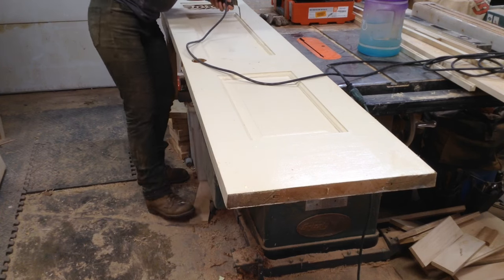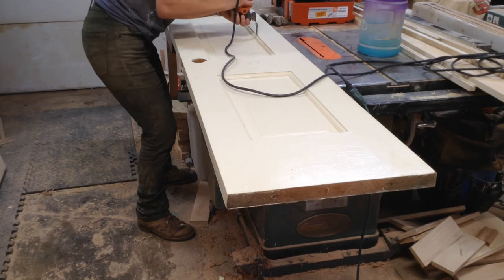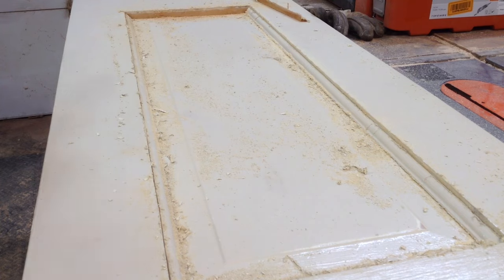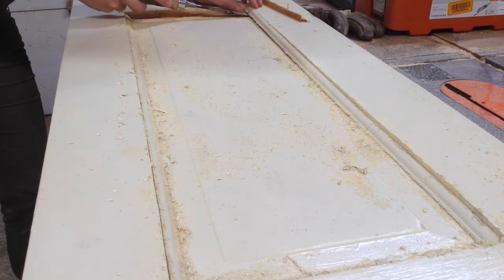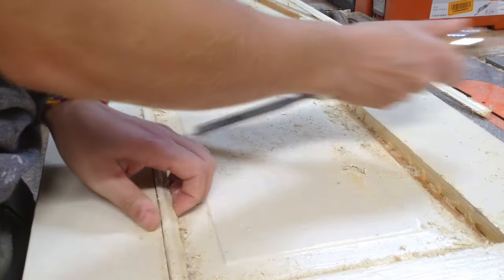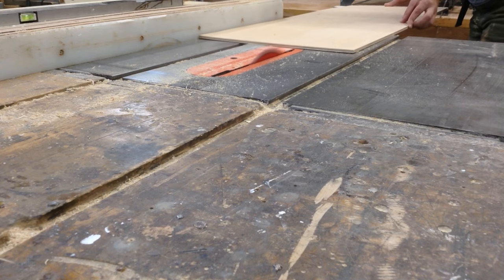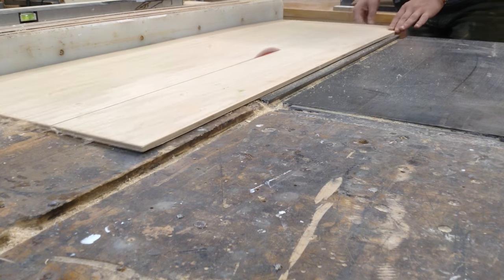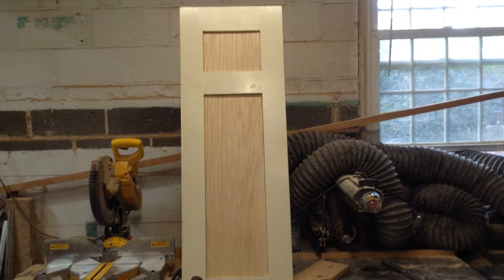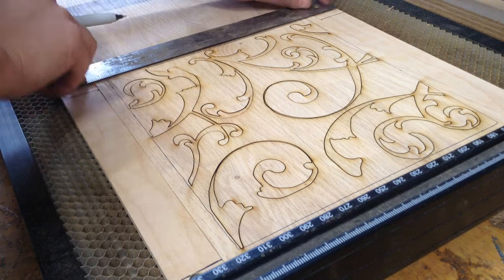The catalyst for the design of the door was the closet itself — it smelled terrible, and especially in the summertime when old smells are reawakened by humidity it really had an unpleasant odor. So I wanted some breather holes in here because linen closets in general are small stuffy spaces, and I don't care how many cedar bags you put in there, they eventually just start to smell. I had permission to get as creative as I wanted, so I decided to take the panels out of these doors. These hardwood doors are really nice quality — they're put together with mortise and tenons. I knew I could take that trim off the front using an oscillating tool, pop out the panels, and then use oak panels in their place. I was a little nervous about losing the raised-panel look but the design completely disguised that.